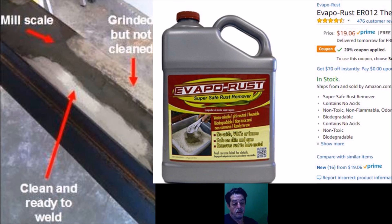If you're going to go the dangerous route with hydrochloric acid, look at it another way — just grab some pool acid and do the same thing. It works just as well. Any leftover pool acid will also clean the tile in your shower and your tools beyond belief. But again, this is a more toxic method, so use all precautions. You can throw rusted tools in a bucket, let them soak, then neutralize with baking soda the same way. It's a redneck method, but it works fantastic.